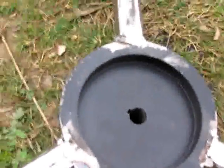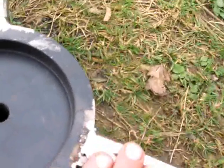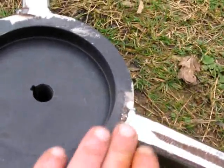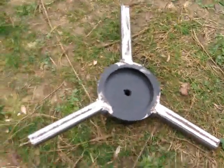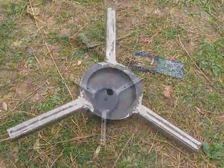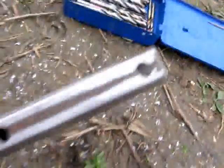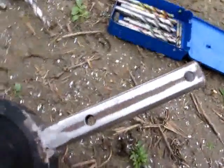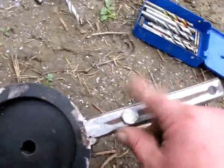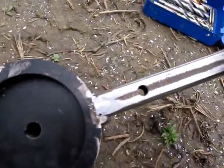The reverse side has been welded and then ground off flush because the blades are going to fit on here. Next thing we'll do is drill some holes and a quick coat of paint. Holes are drilled — these are 10mm holes for an M10 high tensile bolt. Check the clearance is alright and they're lined up reasonably well.